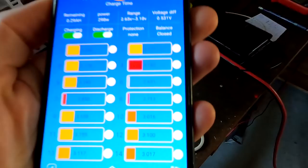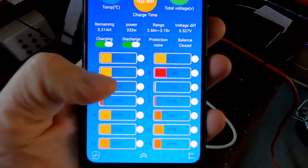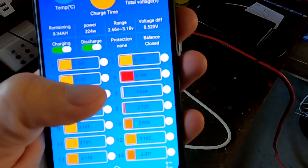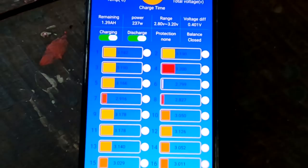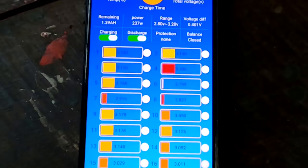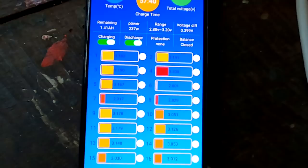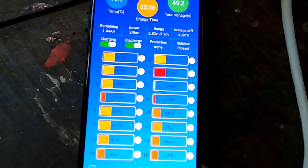We still have no power here. The inverter is still turned off, but why is it doing it this time and not the three times before? I've tested this morning twice and said, well, it's not working. So I got the camera out and did the test again — you just saw it, what it does with the relay on, off, on, off. And now the third time it seems to work. 2.66 rising — just wait until we hit 2.8 in cell number 6 and then the inverter should come on. 2.798, 2.799, 2.8. That's the 20 second delay now. That is 20 seconds at least.